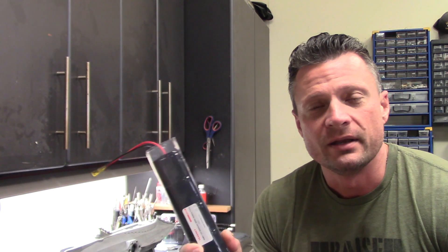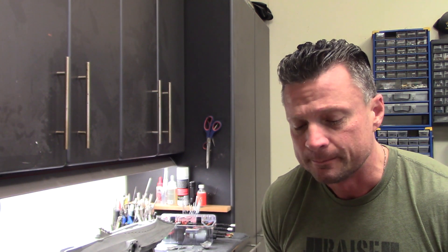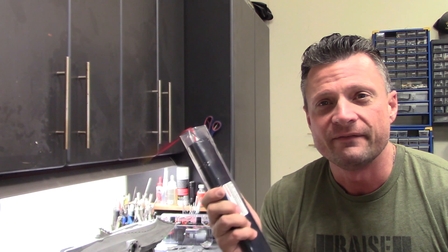For lithium polymer batteries you would want a full waterproof enclosure, mounting them inside your sub driver or dive module. Nickel metal hydride batteries are kind of in between the two in terms of energy density but pretty common for bigger boats. This particular one is going to be going into a Sea Wolf class submarine, 1:96 scale, so it's fairly sizable — it's 12 volt, 5 amp hours.